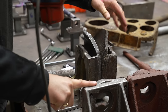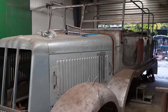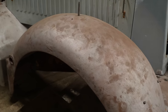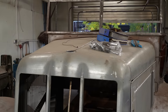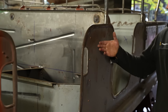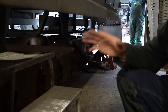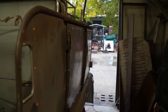These ones are fabricated in comparison to the original pieces here. This is the 12-ton half-track — we restore the body for our friends from Germany. Most of the parts are original; the front is completely new made, but for the fenders we try to use as much original material from this body as we can. Someone made a replica, someone made some repairs on this body, but some things were not properly made. For example, these sides were straight — now Bronek made them properly, changed them properly. They are curved. It's very important to put the body on the chassis to make it straight. Sometimes after the restoration it comes and it's totally bent. Bronek made this body from beginning to end, with a slight bend that presses the corners.